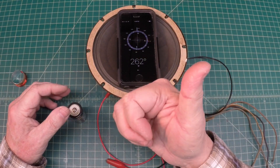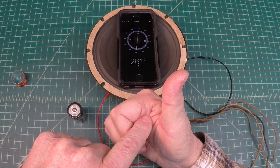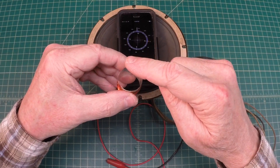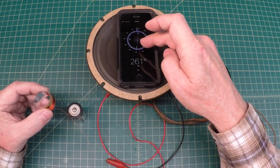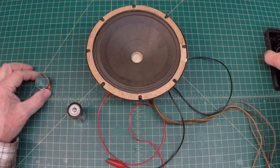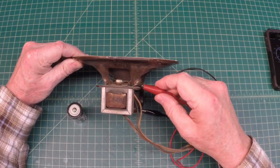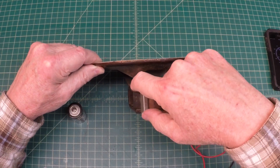That indicates the current is flowing in this direction using the right-hand rule. Counter-clockwise means north here, south here. So looking back down at the voice coil, in this case your north polarity would be here, your south here on the bottom side. Facing the back side of my iOS device would be the north pole. So if you flip this over and look at it, my positive connection would actually be this lead here, and my negative lead here.